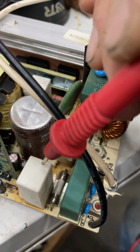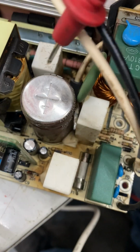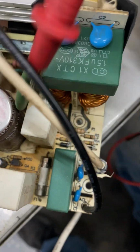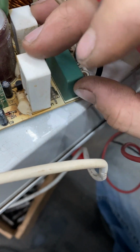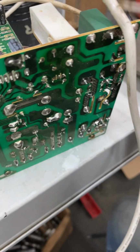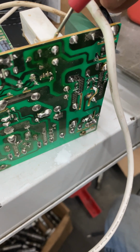These get really hot, so they're wrapped in porcelain to dissipate the heat, and you can tell that they get hot because they even turn the board a little bit brown from temperature. Super common to see, but underneath they glue them so they don't move around. I don't know if they vibrate from that, and with the temperature, the little studs where they're soldered between the board and the resistor sometimes blow out.